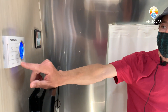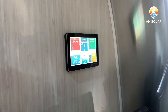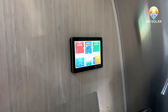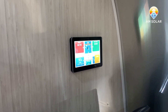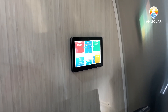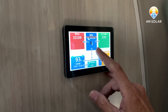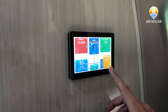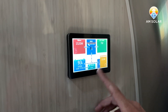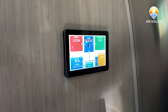Now if we turn one of those off — zone one is off — you can see our AC load support drops. There we go, back to bulk. Turning zone two off as well. Our AC loads have significantly decreased, allowing that 15 amps of incoming AC power to distribute mostly through the charger and support minor loads. All the while, the solar has just been going along for the ride, pouring in power to the best of its ability. The combination of the inverter charger and solar is putting about 97 amps into the batteries. There you go — load assisting with the 50-amp full pass SPS system.